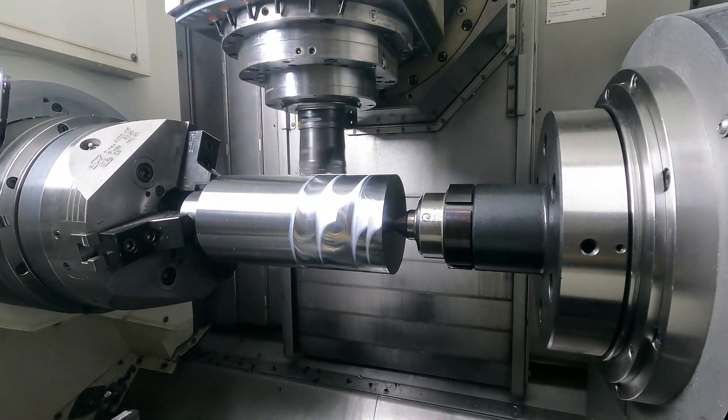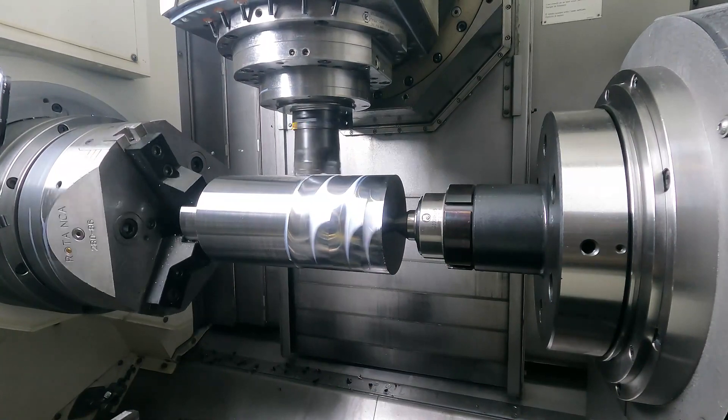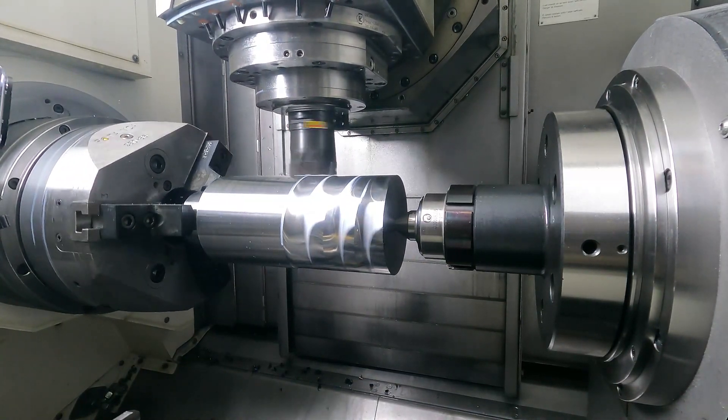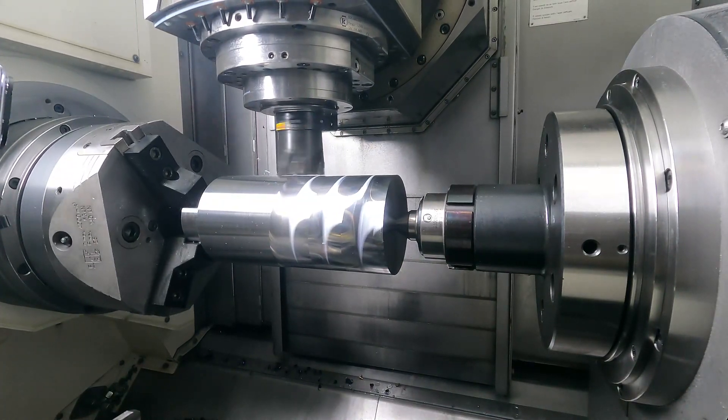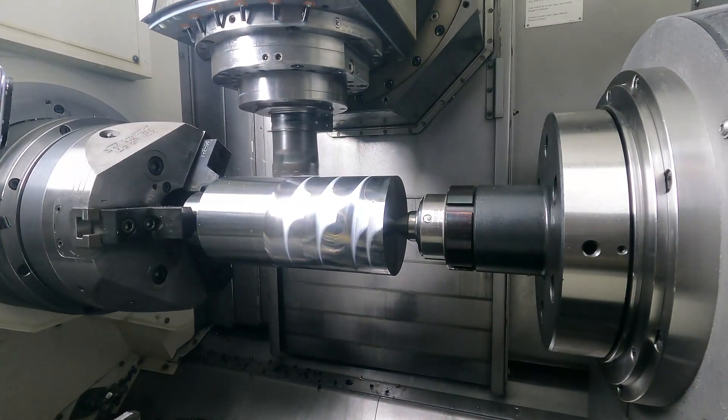Turnmilling is a combination of turning and milling, and in some cases a very good economical alternative to conventional methods like turning or milling. For example, you have an unbalanced part — you have a slow rotation from the component and a fast rotation from the tool. It's very advantageous: better chip control, it's a milling process, short chips and so on. This is an advantage of turnmilling, and in most cases it's a good alternative when you have problems with normal methods.